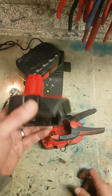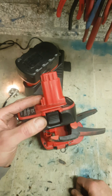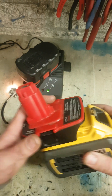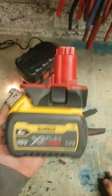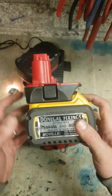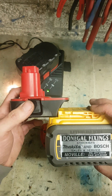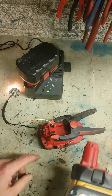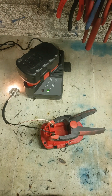The other option is to buy an adapter. This is a Dewalt one for an 18-volt Dewalt — this adapter goes onto the tool so you can fit a lithium battery. This way you can convert your lithium batteries to fit your NiCad tools. We have them for the likes of the Dewalt nail guns — the old type Dewalt gun is the best, so you need an adapter because the batteries always eventually fail. You can probably get one of these for the old type Bosch batteries too — you just need to have the same terminals that fit your tool. That is the battery adapter option.